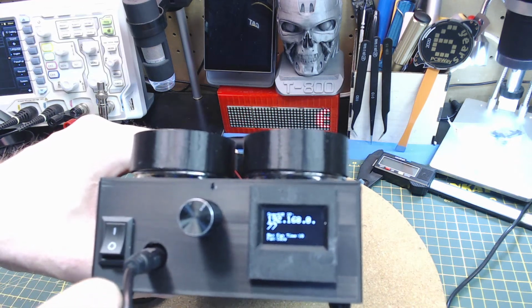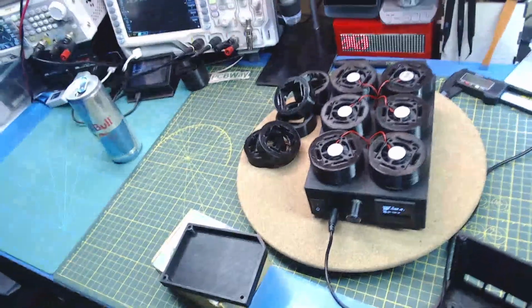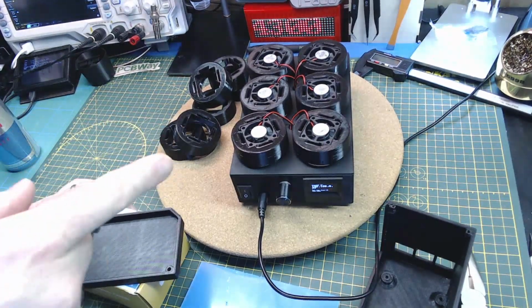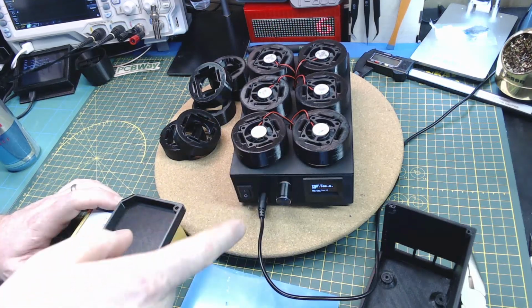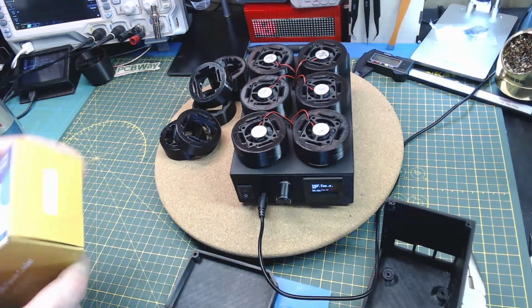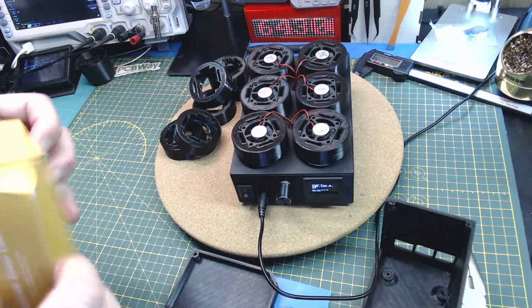The boot up time's extended on this one because it's been programmed probably 600 or 700 times, and I haven't done a full chip erase in probably 400. I've learned that ESP32s keep ghosts of their previous programming, especially on boot. It sometimes can kernel panic if you've programmed them a bazillion times. So anyway, that's why it took a little while. But that same logo that I have on the board is my splash screen.